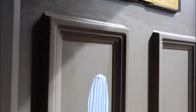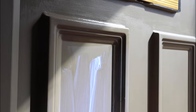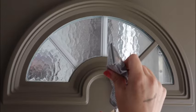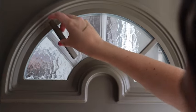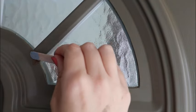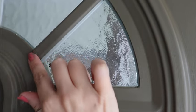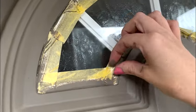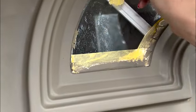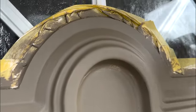Between the clear coat and the built-in top coat already within the silk paint, we'll see how well it holds up. The first two to three weeks is when the paint is most vulnerable to scratches, so I'm going to be extra careful in that time. After painting the wooden pieces, I attached them to the glass with some E6000 glue and secured them in place with frog tape. At the edges I used a little bit of wood filler to disguise where they weren't perfectly curved along with the shape of the door. I removed the frog tape after the last coat of sealer was on while it was still wet — the best time to take it off, as dried tape can peel off paint.